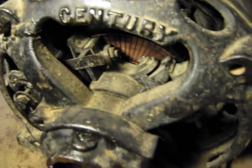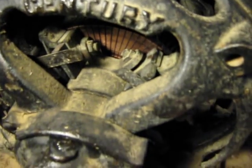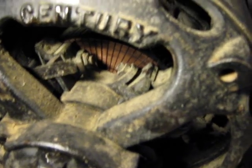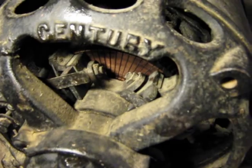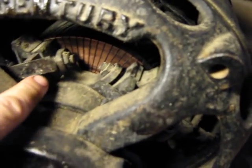I've had to disassemble it and replace the short-circuiting necklace, which slides up and shorts all the commutator segments when it's running, because that was stuck and full of gum and rust. The difference between this and a more modern motor is that instead of using a capacitor to develop starting torque, this one uses brushes on a commutator.